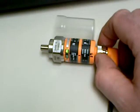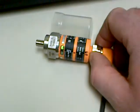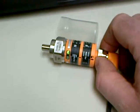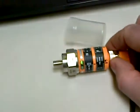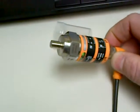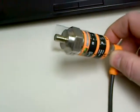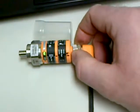My primary area of application for these is in the mobile field, so that's essentially what I'm looking at. In the industrial field you generally have 24 volts available so that's not a problem. The sensor can be mounted with a couple of different options — you've got a magnetic mounting base or a glue-on mounting base that you can purchase from IFM.